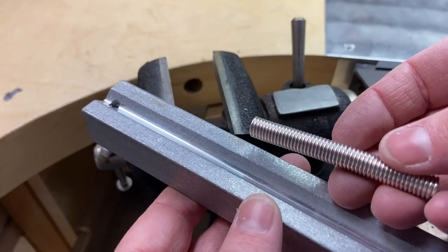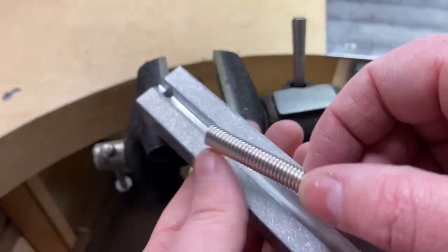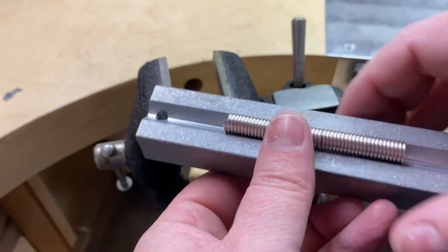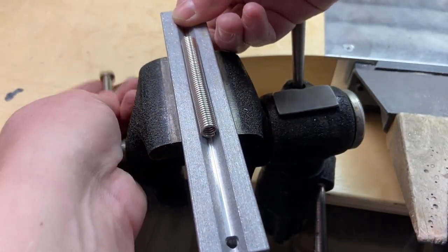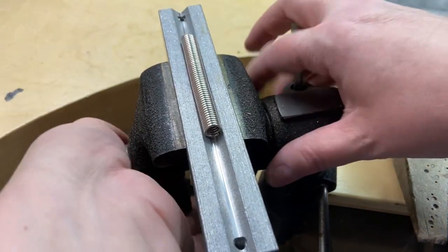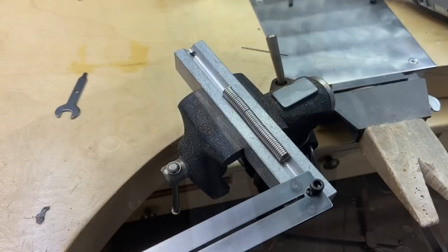Before you begin, determine which side of the base you need to use for the size of coil and diameter of wire you'll be cutting. To check, place your coil in the base and rest the base top on the coil. Place the coil holder base in a vise. Never hold the coil holder base in your hand while cutting.